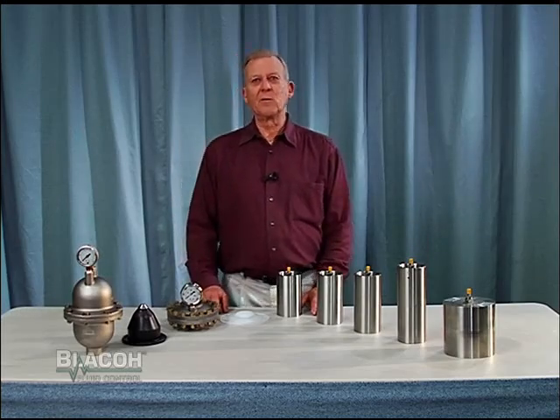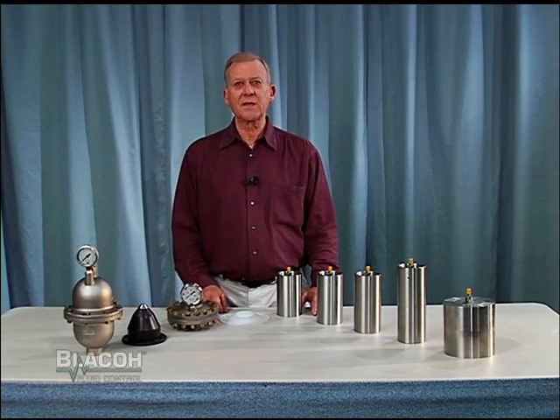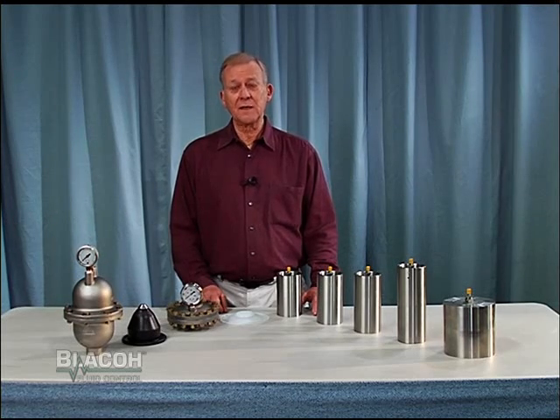The inlet is available in 1/2 or 3/4 inch threaded NPT and flange inlets. The HP2 is designed for applications which have small flow but high pressure. The dampener is 12 cubic inches in capacity and designed to prevent pulsation in injection applications and other applications where high pressure is required to interface with another fluid, but steady flow is necessary.